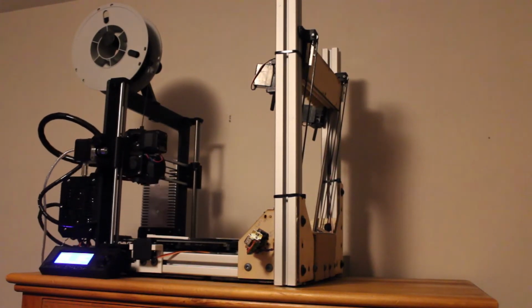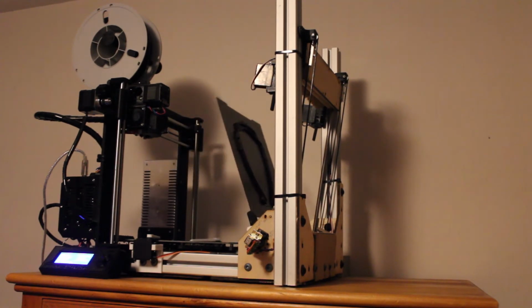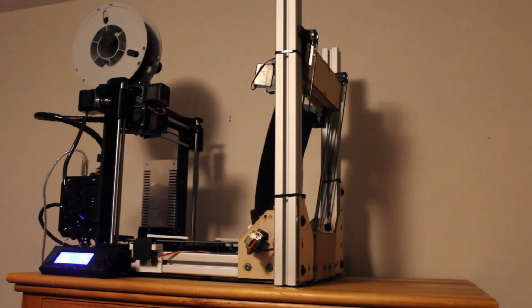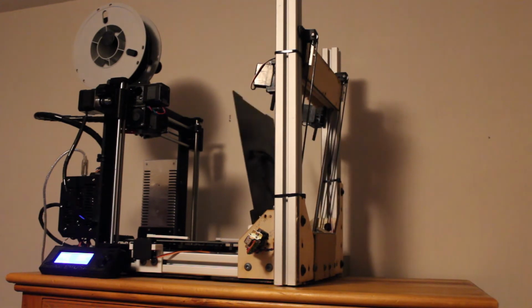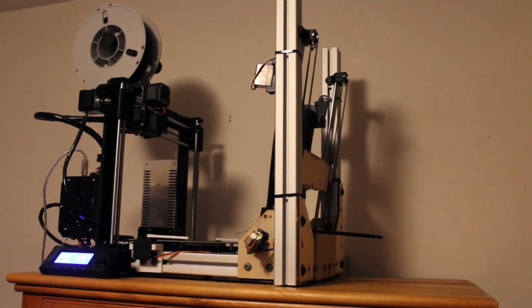The mechanical system is designed to bolt onto the front of the printer using the 80-20 extrusion of the Prusa Mark III. When the printer's y-axis moves forward, the build plate engages with a motorized pivot to lift the bed off the printer into a vertical position. Once vertical, the print bed is locked in place with a pair of servos, and the rotation motor flexes the bed back and forth. The brush then moves across the print bed to dislodge the part if the flexing doesn't fully remove it. After the part is removed, the bed is rotated back down, and then the next print can begin.